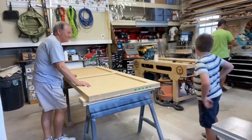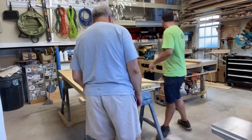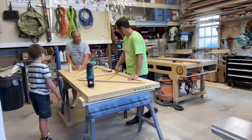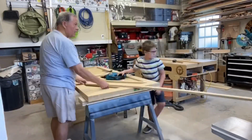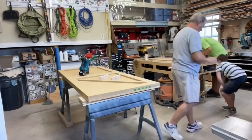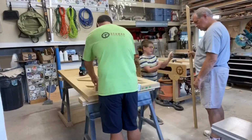We now laid out the inset piece for each door per the design of the customer. Then glued and brad nailed these into place as well. And we cut a couple spacers to make sure each trim piece was properly aligned and spaced out.